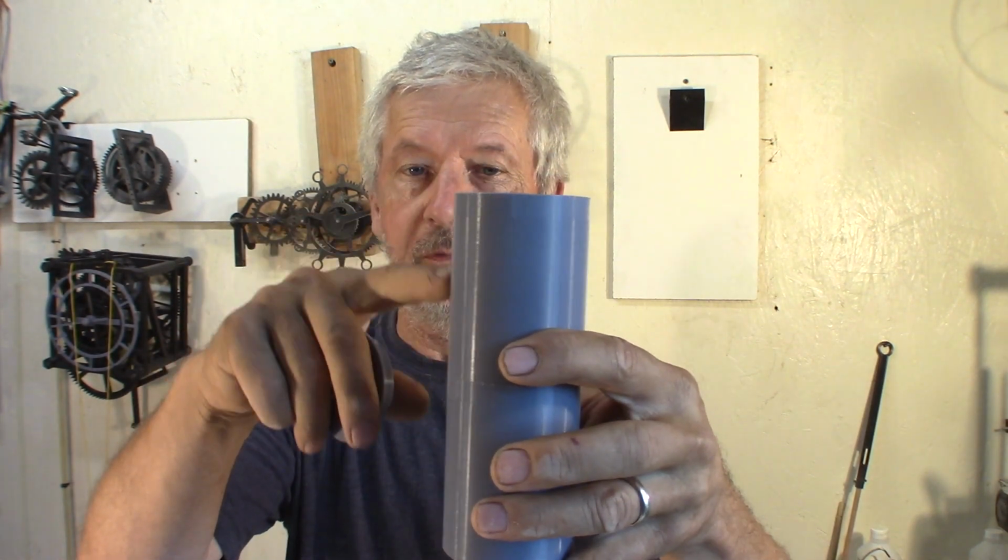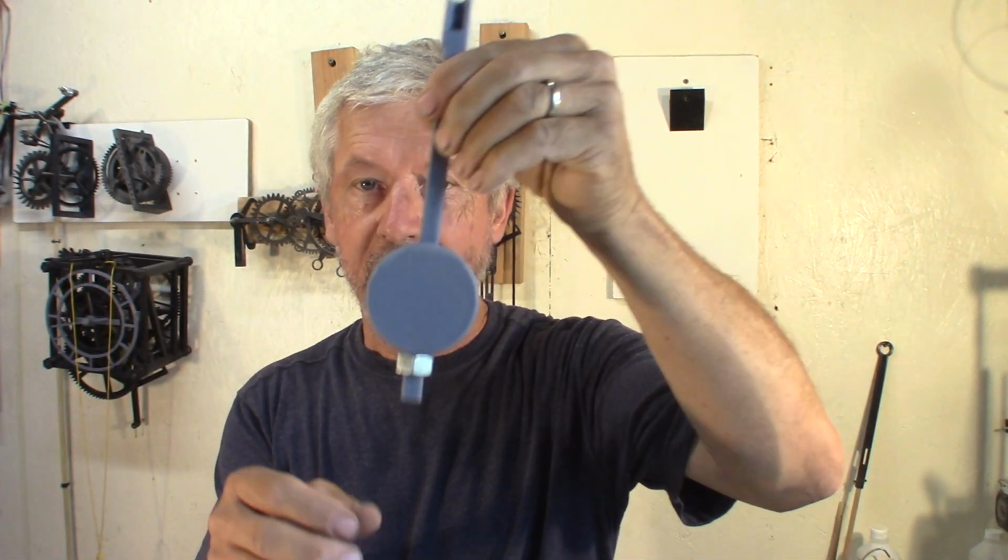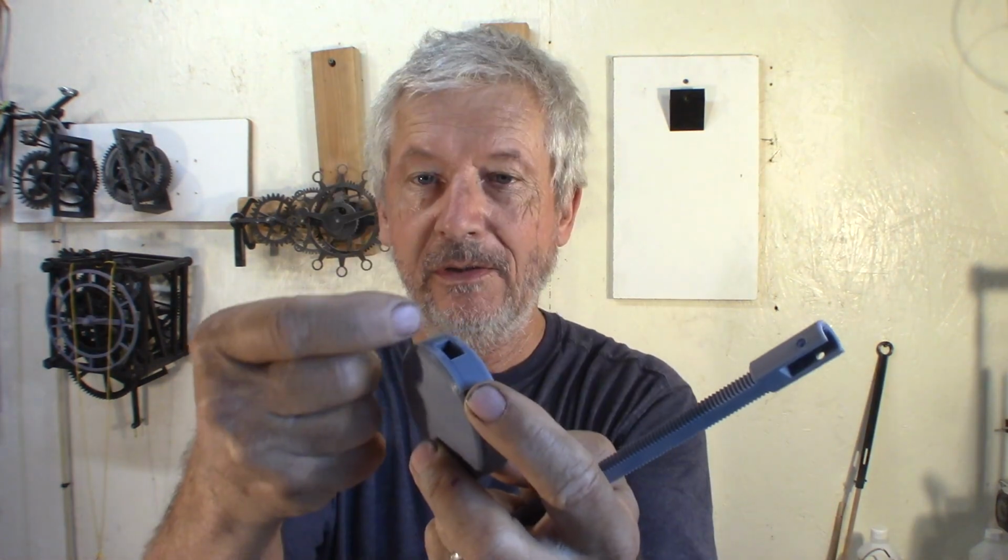One section like this is 800 grams when it's filled up with those steel balls, so you can add as needed. I made a bigger hole at the bottom so the string, or a piece of wire, can go all across. That prevents layer separation here when you start having a couple of kilos of weight pulling down. Also put some of the steel balls inside the bob. Take it off the rod. There's a hole to fill up. And once you put it back, the balls are in there but they cannot come out.